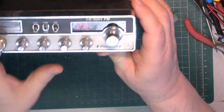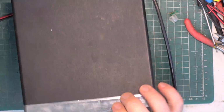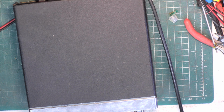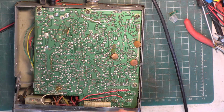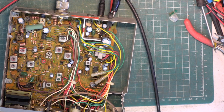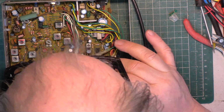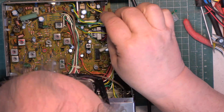So, we've got it lighting up as Mark says. Let's put it on channel 20, we've got no meter lamp. Let's see if it works in PA. Testing 1 2, testing 1 2. It doesn't work in PA, so chances are the audio IC's been cooked. I bought an LA 1213 for a reverse polarity Amstrad 900, which I've not done yet, so hope we don't end up using it on that.